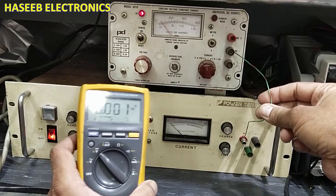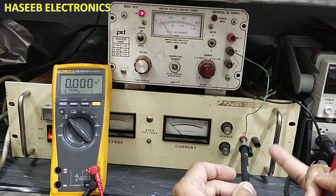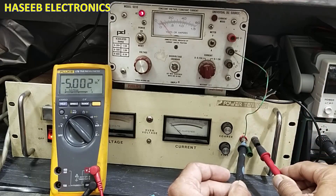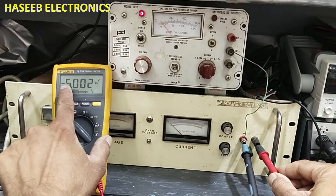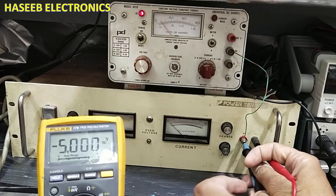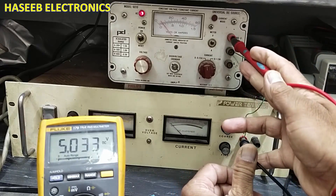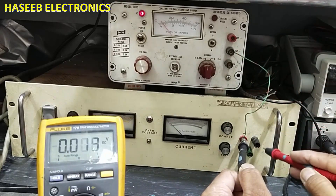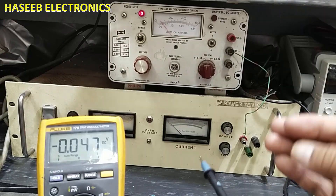The positive of this power supply is connected to the negative of this power supply. This pin — the common pin — is our ground level. We will put the common lead, the black lead, at this ground level, and connect the red lead to this terminal, so it is giving minus 5 volts. We can see the minus sign here, so this is the negative power supply. And if we check this one, it is 5 volt positive.